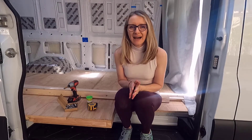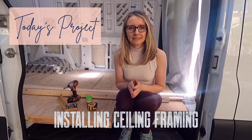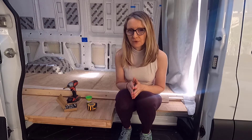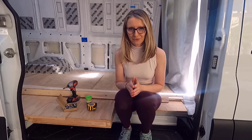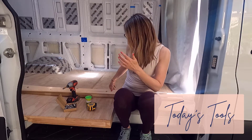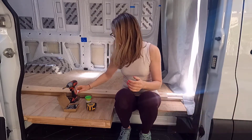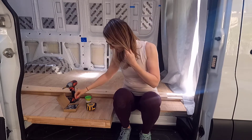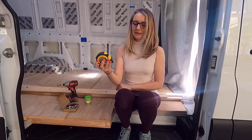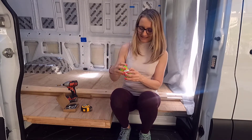Hello and welcome back to the channel. Today I'm going to be doing framing of the walls and ceiling, and I'm going to be using largely 1x3 — or nominal 1x3 — furring strips. 'Nominal' means it's not exactly 1x3; it's basically a way of describing these super light strips. My other tools today are going to be a chop saw, fabulous little hex bolts and a bit for that, a screwdriver, a tape measure, and a pencil.